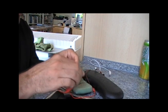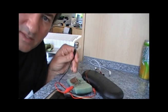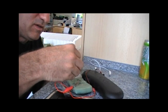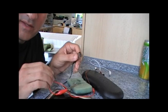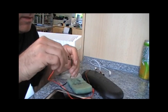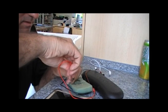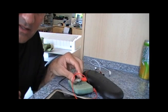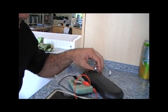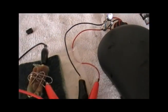We can disassemble this circuit to show you how simple this is. It's basically a beer tab. We're taking a piece of cloth soaked in sodium hydroxide solution and wrapping the beer tab. Then we're taking a bunch of paper clips and clipping them on. And as you can see, the LED goes on. You can't get much simpler than that — there's the LED glowing, and there's the circuit.